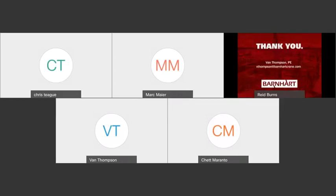And Van, the last one I see, and I'll take one more look while you're addressing this one, is from Steve. Is there a practical limit on weight or height for these type systems? Good question, Steve. I may be misinterpreting your question, and if so, contact me after the webinar. But practical limit really boils down to trucking. What you're seeing in the industry now is higher capacity gantries that are getting up into the 1,000 ton, 1,300 ton, and they're really great. They can get you up to 40 feet with heavy loads, but you'll spend more in trucking to get them there. You'll only be able to get, say, one housing plus some track on a single truckload, whereas some of the lower capacity units that have a lighter housing weight, you can ship around a little bit easier.